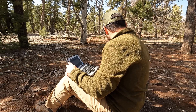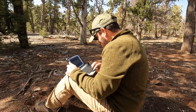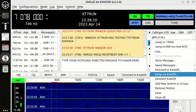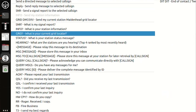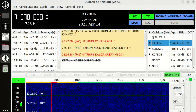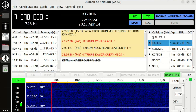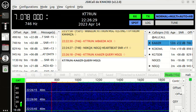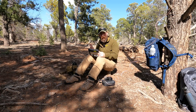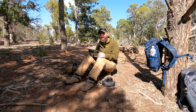When I did that heartbeat, other stations knew I was on the network and lit up all of these little star indicators for me. According to my notes, Mike told me he left messages for me on Whiskey Bravo 6 Echo Delta Kilo and Kilo Alpha 6 India Zulu Romeo, and it looks like both of them are actually listed. So we're going to right-click on KA6IZR, do a directed message, and query: do you have messages for me? If this works, we should receive an acknowledgment that yes, there is a message for me, it'll give me a message ID, and then I have to submit another query.